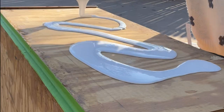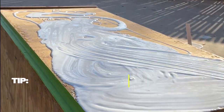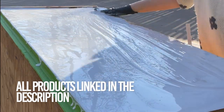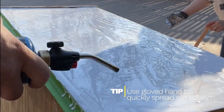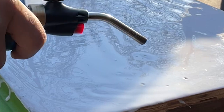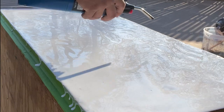It's time to pour the epoxy. I got brave enough to do it and got started. What I realized is that I had not made enough of the base coat, so we had to spread it out pretty thin — and that was okay, because this is what it was for. The testing piece was for us to get some practice. It is so much easier to use your hands and gloves to spread it out. One thing I learned is to use a torch to get rid of the air bubbles that are coming up. As you can see, they just pop and go away, and you have a much better-looking, smooth surface. You can use a heat gun or a blow dryer, but the torch seemed to be my best option.